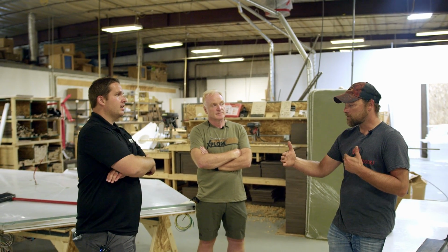Isn't that interesting? I don't know them off the top of my head, but there are some calculations. Your studs are bringing in almost enough cold, and it can accelerate the cold. So if you've got a stud cavity that's 16 inches wide, but you've got big hollow aluminum tubes every 16 inches, and there's no thermal break, you'd get 0 performance difference. You could take that insulation out of the wall completely, and you wouldn't notice, because it offsets it.